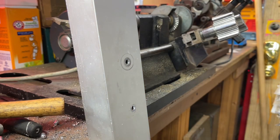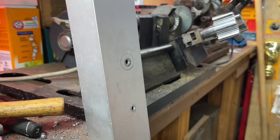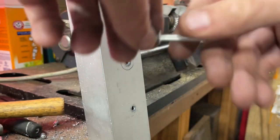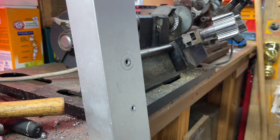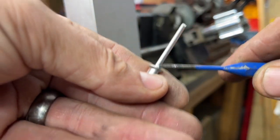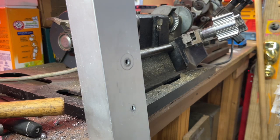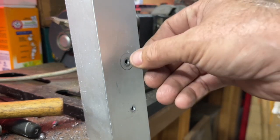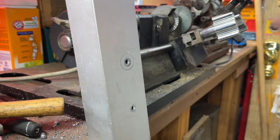So one of the things that you've got to deal with when you're talking about rivets is the rivet breaking off halfway. What happens is it'll be half in there, the shaft will break off. What you have to do is take a pair of pliers, rock it back and forth, and then take a punch, boom, boom, boom, because you're going to have this little area sticking up and you're going to need to hammer it flat and then drill it out. It's kind of a pain in the ass. I'm glad we didn't have to show it, but it does happen. That's one bad thing about rivet tools, is when the shaft breaks and you're only halfway done. It causes some issues, but it is what it is.